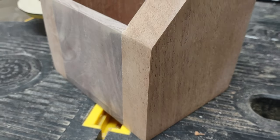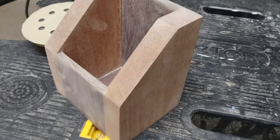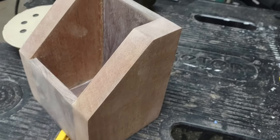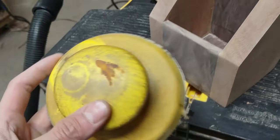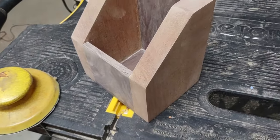This thing's starting to look pretty good and I'm going to do two more finishing touches before the actual finish. I'm going to hit it with 400 grit real quick — just a quick wipe down, it's going to make it nice and soft — and then I'm going to put a nice light chamfer on the outside with 200 grit on this sanding block, counting my passes, and we'll end up with a nice little chamfer.